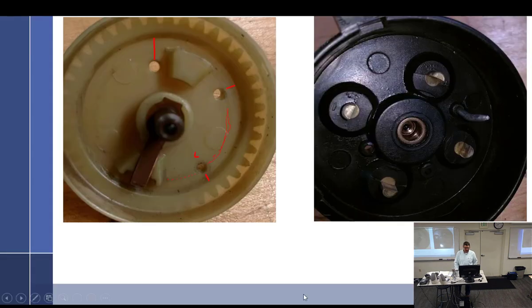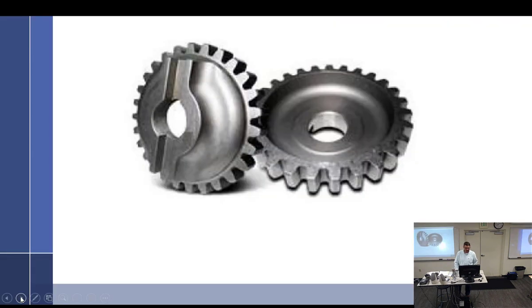This part is not on the test, but I will tell you this. For those of you who remember, every now and then you'll be putting a magneto on with slots. And you put it on, and you try and time it, and it whacks into the stud. You're like, oh my God, I got to take it off and do a tooth. So you try and take it off and do a tooth. Now, one tooth over, now it's smacking down here. And so you never have enough. So how do you fix that?